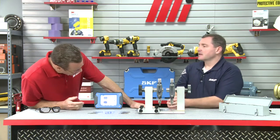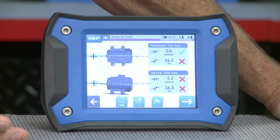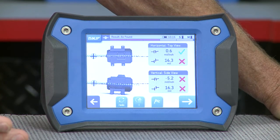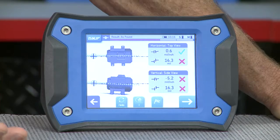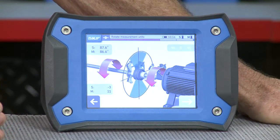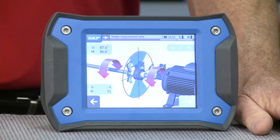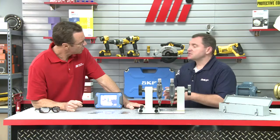I've got a check mark and three red X's, so we're out of alignment. On the top it's showing us the horizontal misalignment, and on the bottom it's showing the vertical. So we've got to make some adjustments. Go ahead and hit the bottom right-hand arrow key. Now the lasers are going to tell us to move to 12 o'clock or 6 o'clock position, because when you do an alignment job, you always want to do the vertical adjustments first.